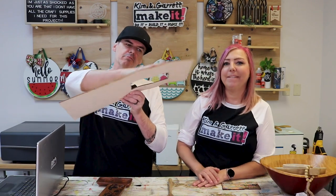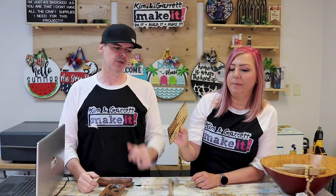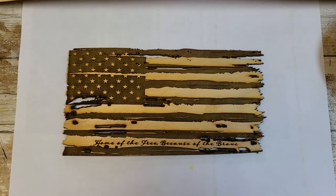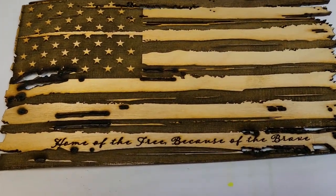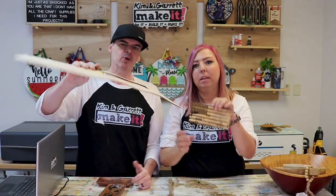We also tried a really warped piece of plywood to see if we could salvage it. There isn't a cut feature in curved surface mode, but the score feature is slow enough that you can actually cut through eighth-inch material. In the score settings I selected 20 millimeters per second at 100% power and it went right through the eighth-inch Baltic birch. The result looks like a waving flag — I had a wavy piece of plywood, so why not put a flag on it?